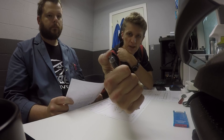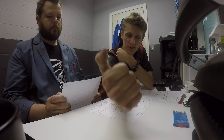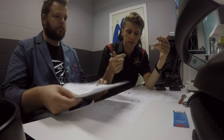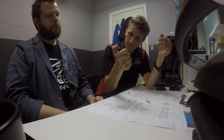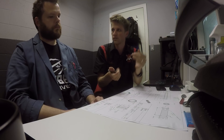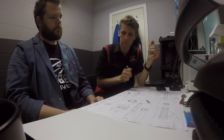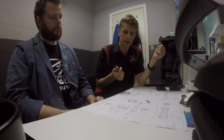Something that's been bugging me is when you just gently, slowly click it down, you can feel the tool path line — the feed forward line — the RA of that surface. You can feel every little bump because the ball bearings are balls; they'll follow every contour. So I'm going to polish that surface nicely, smooth, on the lathe in one operation, and that should eliminate it.